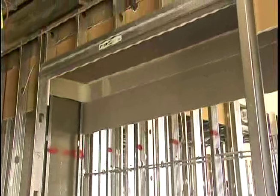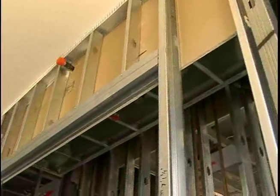And that's it. No additional cripple stud receiving track, no bulky built-up sections, no welding required, and the flush-mounted screws leave a smooth framing substrate for the best drywall finish.